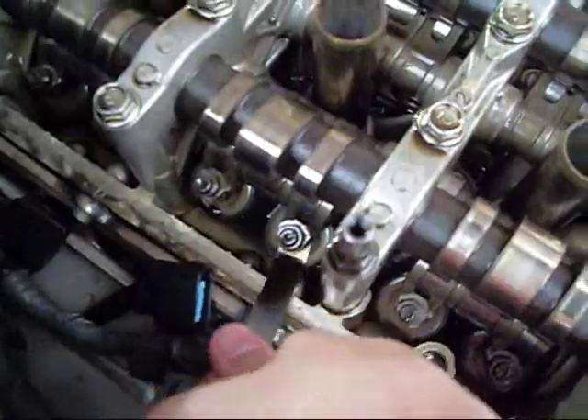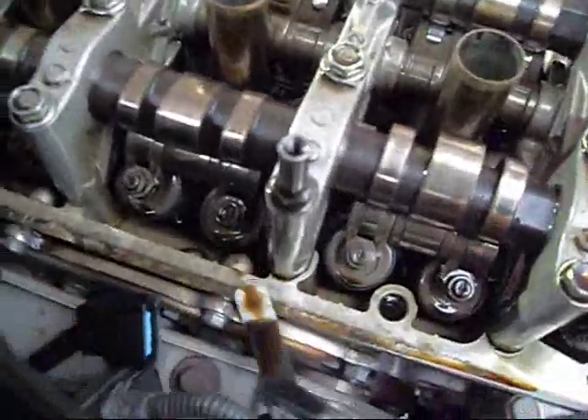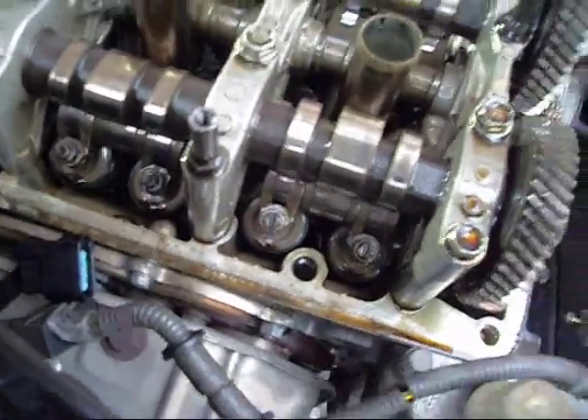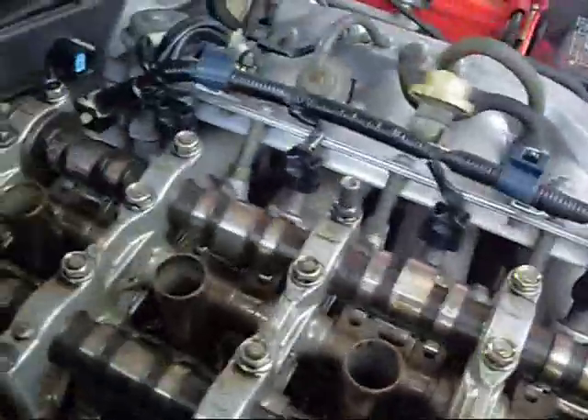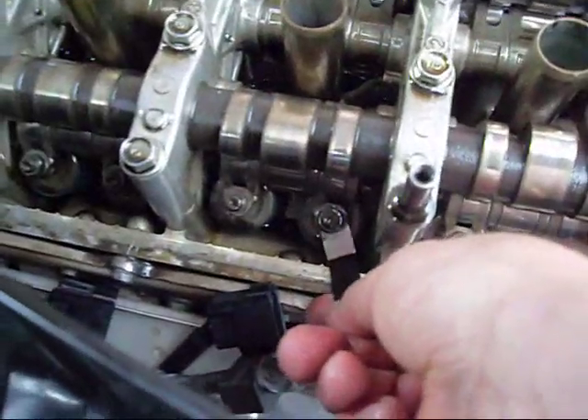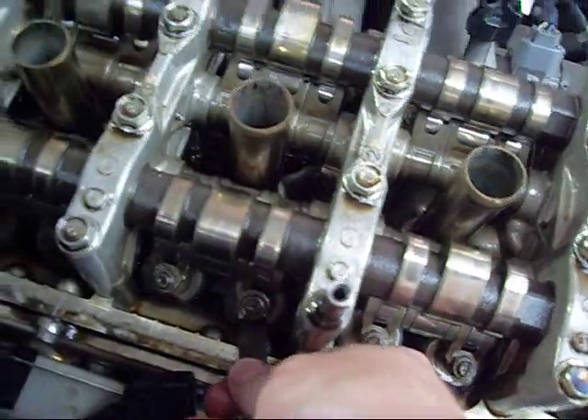I've torqued it down sufficiently. Checking again — yep, can't get that out, which is good. That's why I have a trusty pair of pliers. I'm going to pull and out it comes — great. So that was my no-go gauge. Now I'm going to check I've got tolerance by using my 9 thousandths gauge.